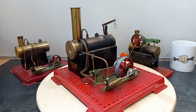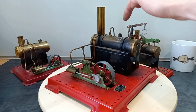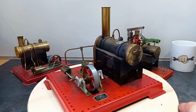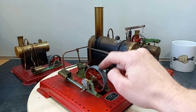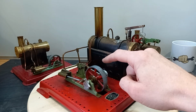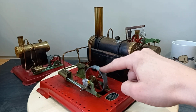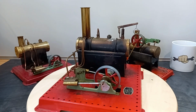Okay, so that is the 3 seals replaced and the O-ring replaced on top of the steam pressure relief valve. Whistle's in the right position now and nice and tight, so it's watertight. The leak we saw earlier has gone. The cylinders are a lot more smooth now. In fact, you can see that the pressure difference being created by the suction effect of those pistons is actually pulling them back, so that's an encouraging sign.